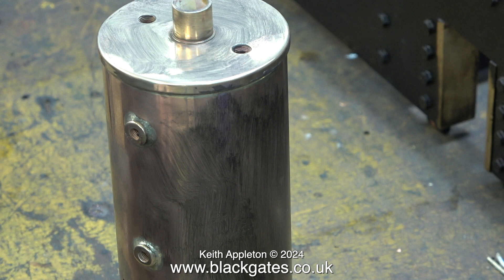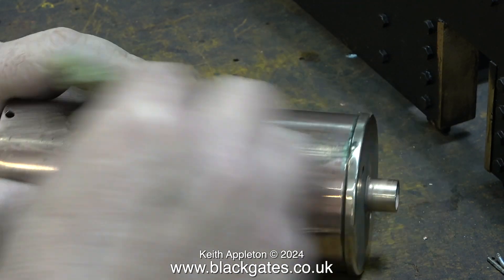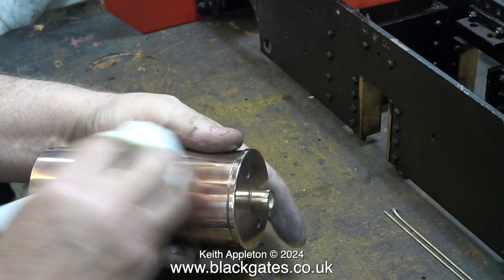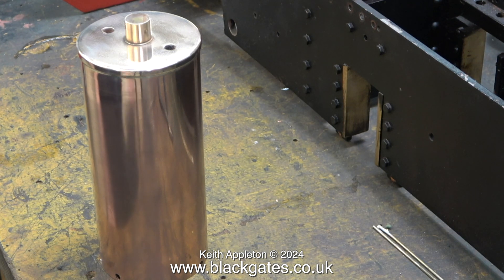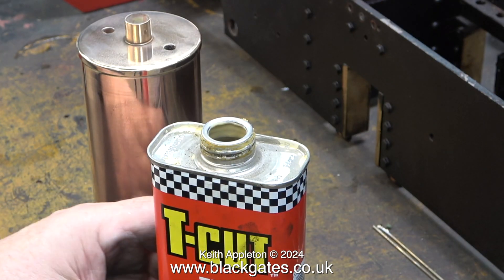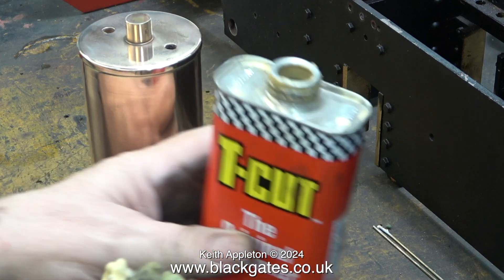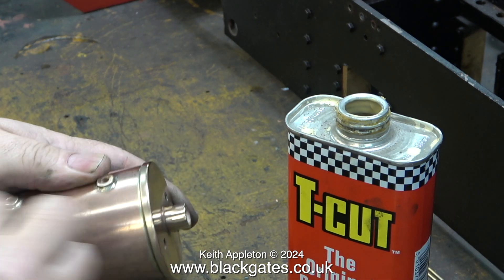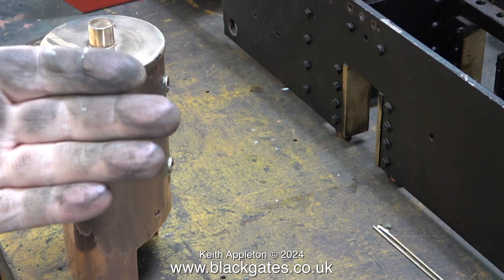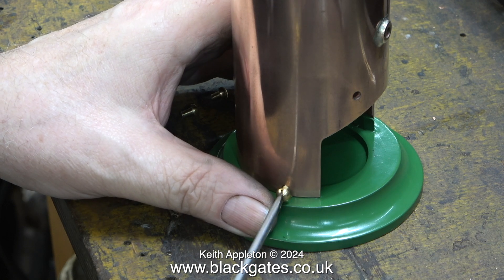In reality I didn't use any brass in the construction of this boiler — it's gunmetal and phosphor bronze, and the outer shell is of course copper. This polishing job was starting to get a bit tedious, so I wondered if I could supercharge the operation. Top tip: when cleaning up brass parts that I can't use the polishing spindle on, I use T-Cut on a cloth — I hold the cloth in the vice and rub the part against the cloth soaked in T-Cut. T-Cut is an abrasive cutting compound often used for cleaning paintwork on cars. I poured some onto a piece of Brasso wadding and apart from my hands getting very dirty, it did improve the time it took to clean the boiler.